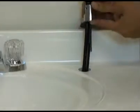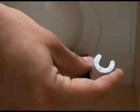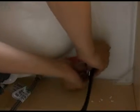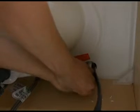Once completed, both hoses should be pushed all the way to the top and we can now slide the faucet into place. The first piece we need to install on the bottom side is the mounting plate. The next piece is a plastic spacer — make sure the open side goes to the top. Then add your washer, the locking washer, and lastly the nut to hold it all together.